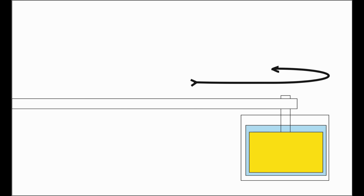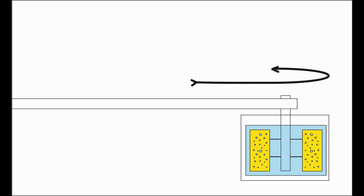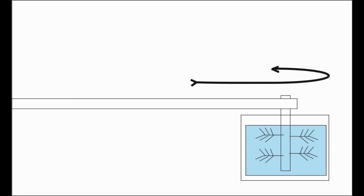You could use a cylinder inside another cylinder with water in between, or push water through small holes. The friction on the sides of the holes would heat the water — there's enough friction in moving water to change kinetic energy into heat energy. We know all that's possible, but how practical is it? You can bring water to boiling point simply by whisking it, but you need to whisk it very, very fast and for a long time.